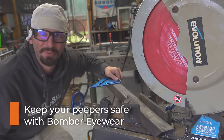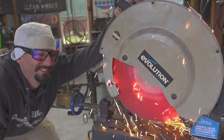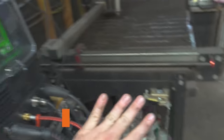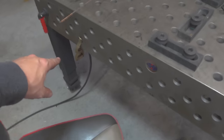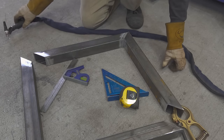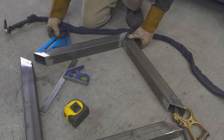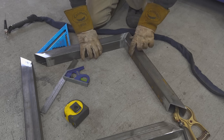Let's get our equipment on — we've got the Everlast Typhoon 230, what a spectacular rig. I've grown quite fond of it. We're going to be running our TIG torch today. The tricky part is going to be getting the ground on the tubes when they're all put together, but as of right now we can just stick the ground right in the end of it. Building a frame, no matter where you build it — jack stands, on a table, on the ground — it is easier to build with jigs and fixtures, but it's not necessary. The ground is not level, but we can still work with it with a little gumption.